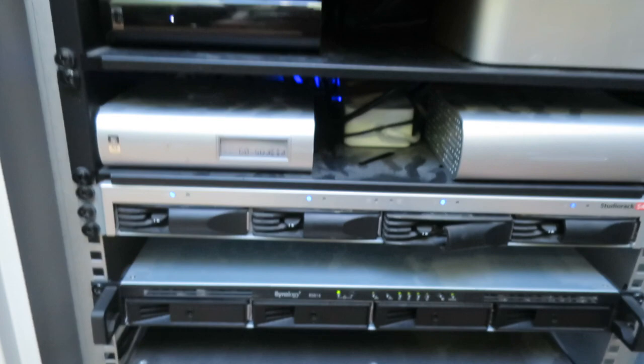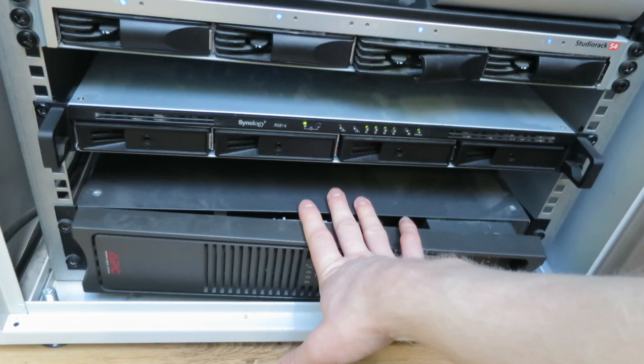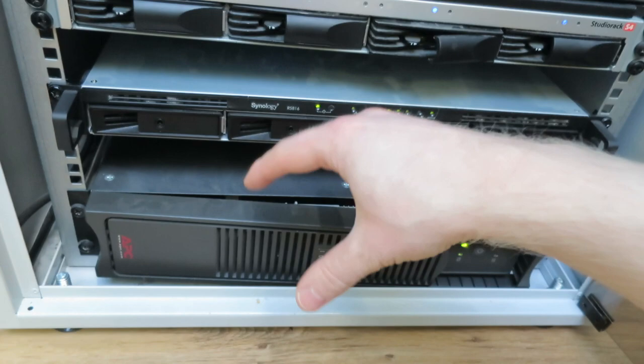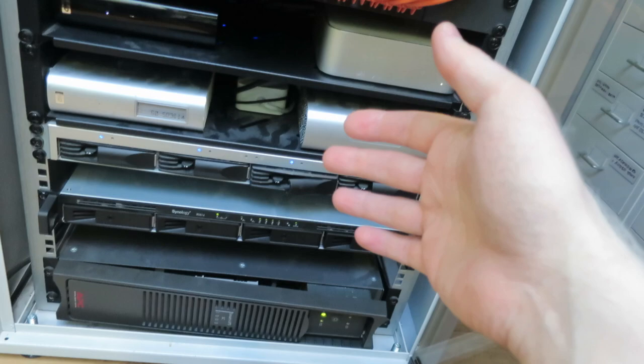So today, because we are going to be moving the UPS and mounting the UPS in a more permanent position, I'm going to take that opportunity to mount the 120mm intake fan with a dust filter at the bottom of the rack. Now to do this, we are going to have to completely empty the rack, tip the cabinet on its side, get a proper mount going, put the dust filter on the bottom, and then put it all back the right way. And we're going to put all the equipment back in a different order as well and prep the rack for the future, like I said.